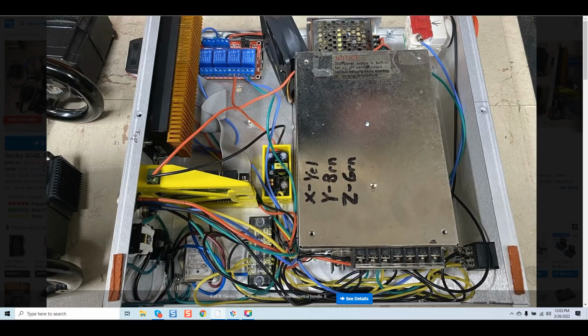That's why on the previous system, earlier in the first portion of the video, I showed you on my system where the ground bus is. And that's exactly why. The E-stops in my system also use tin-braided copper shielding, and I build those. I actually did a video showing you how I build them, where I use 20-gauge silicone leads. Again, there's no current going through them. It's breaking a ground. And it goes right back, and we use tin-braided copper with heat shrink over it, solder a lead to it with a ring connector, and that goes right to the base of the power supply, which, of course, my chassis have full continuity as far as ground. So you're all set with that.